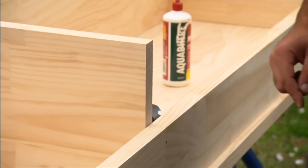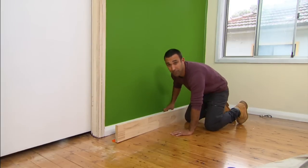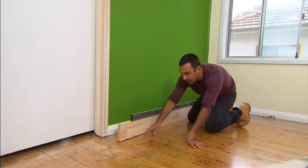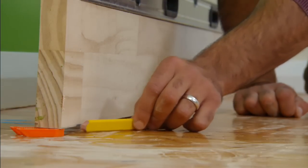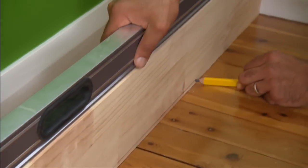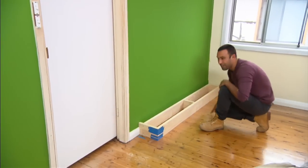This step down will make sense a little later. Even in new houses the floor can be out, but in old houses there's definitely more chance of it, so I want to pack the plinth level. You can see there's a big gap here and it runs out to nothing down this side, so I'm going to scribe the plinth following the floor, plane down to that line, and then I can assemble it. With the level base, we're ready to put our shelves in.